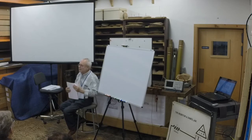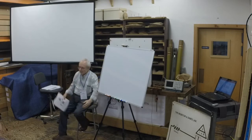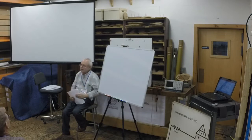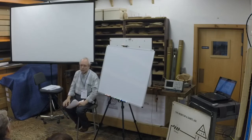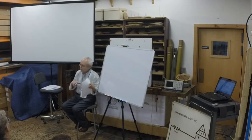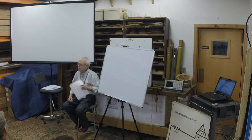What does happen typically in organs these days is instead of having one massive brick of a power supply doing the whole organ and being cabled everywhere, is to distribute power supplies throughout the organ. Typically, in the case of organs with slider motors that can each draw up to 3 amps, there'll be a bank of slider motors at a wind chest. There'll be some sort of solid state control to drive them, and then you can locate a power supply right there, which might provide 30, 35 amps, 75 in a really, really big division.